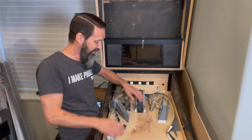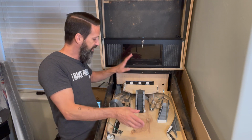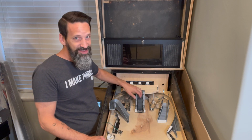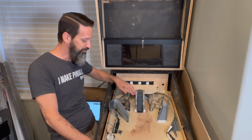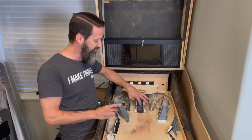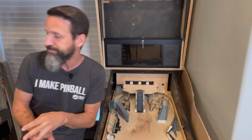All right. So I removed my homing switch because it goes the wrong direction. It kind of bends it the wrong way. I turned it on, let it go, and I saw that it was going down. So I had to change mine from counterclockwise to clockwise. And now when it starts out at home, it's going the right direction. So then I could safely put in my switch. And then when it hits the switch, it stops in the right spot. Okay. So that's homing mode, switch, and direction.